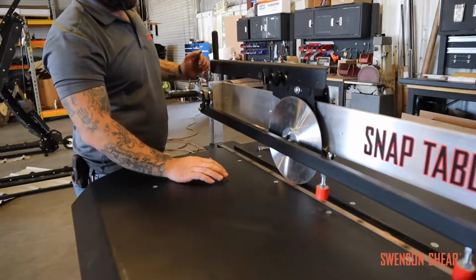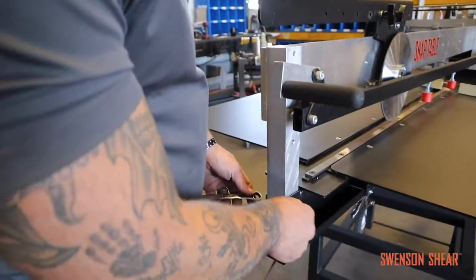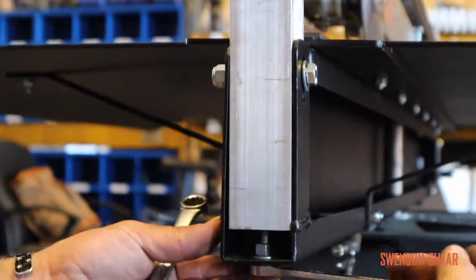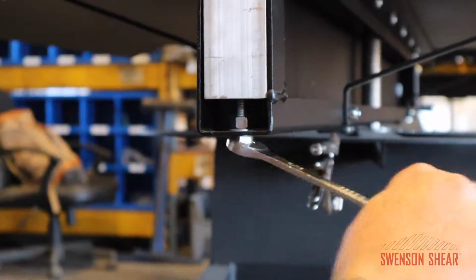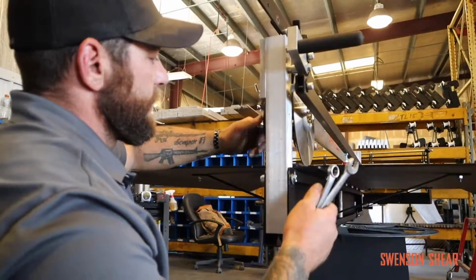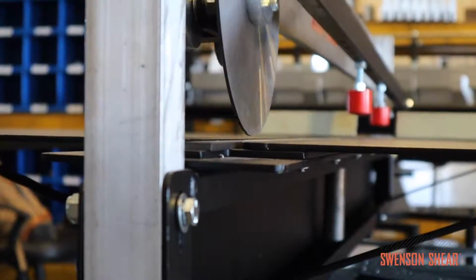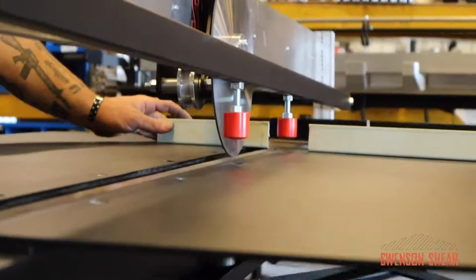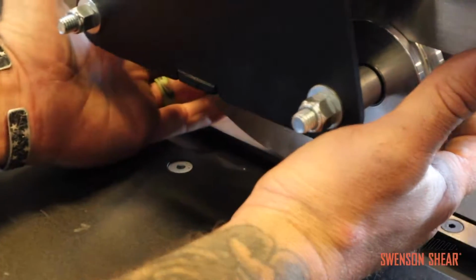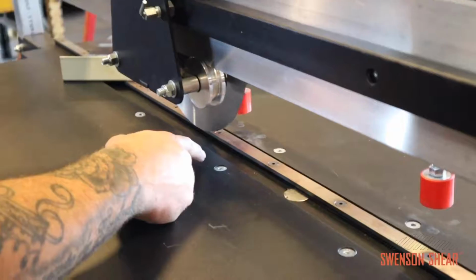What you're going to want to do is come to your side post, loosen up your side bolt that locks it, loosen your bottom bolt. This is going to take off any tension that is on the blades themselves. Once your blade is free spinning above the other blade, you'll be able to start bringing it back until it starts to make contact. Once it is about to make contact, using your hands carefully, pull it towards you until now you have your overlap back.